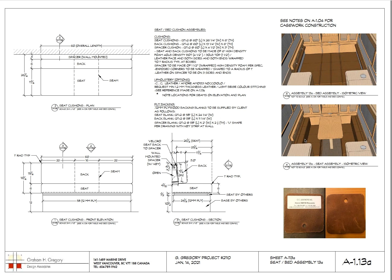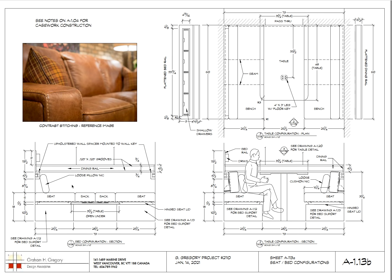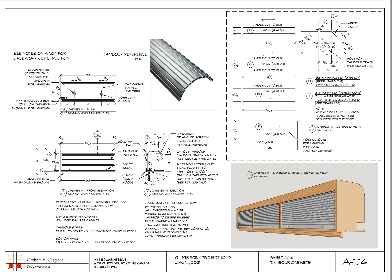We specified the leather for our settees. When we had the leather made, we had to provide the upholstery person with a guideline: dimensions, how it was going to be fastened, kind of foam, radius, how they're fastened, what leather. If you're doing something custom, you need to tell them all of the above. It saves money too because everything is figured out for them — kind of like shop drawings. We laid things out so they could build it.